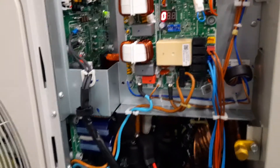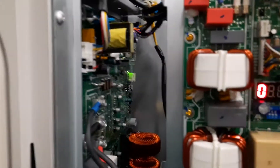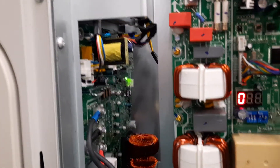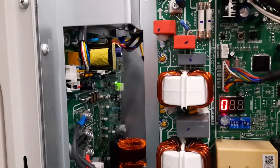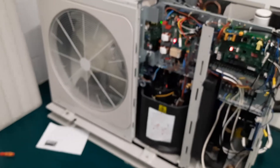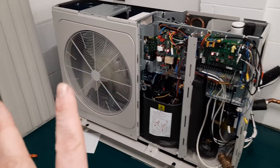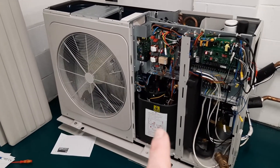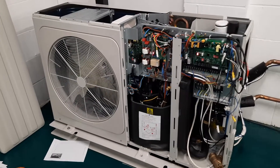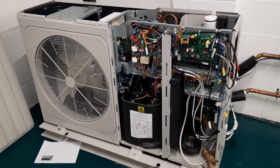If you have an L fault code, turn off the power to the unit immediately. The green LEDs will stay on for about a minute — wait until they've all gone off so the whole thing is completely dead. Then power it back up again, check the green LEDs, and start the machine. When the machine tries to start — it will take about six minutes so be patient — check whether the fan spins at all. Also see if the compressor tries to start; it should start smoothly, but sometimes with inverter problems you get loads of shaking and shuddering.